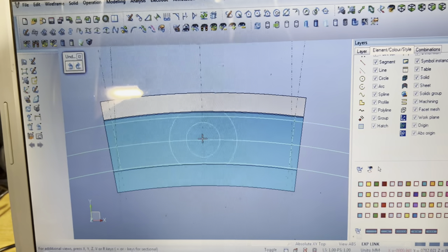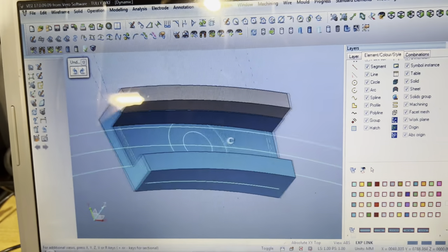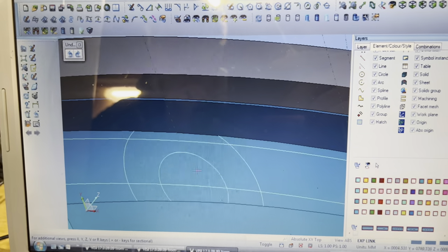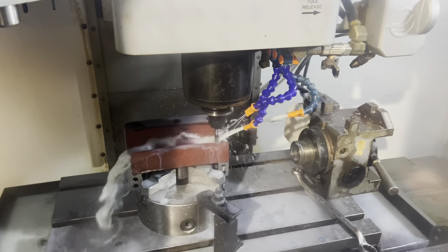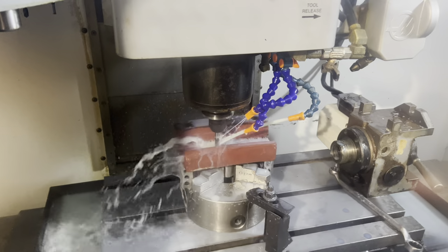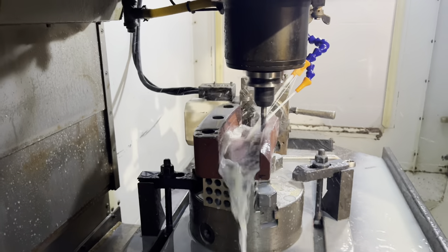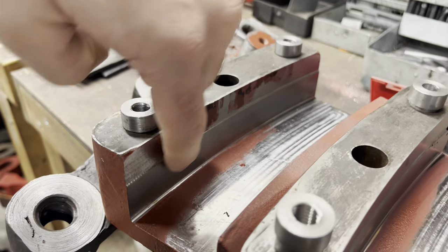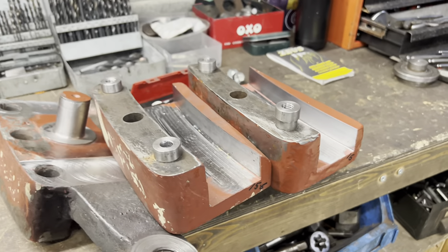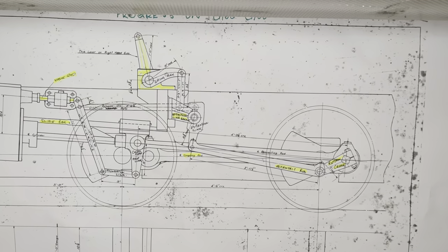The machining of the slideways in the expansion link was a little more tricky. The drawing shows what we found in reality — there was a larger gap at the back than at the front, meaning they'd worn more toward the back. We took a decision as to whether to machine them symmetrically around the centre again, or to just make new smooth surfaces and make an adjusted die block that was larger at the back to match what we had. We ultimately decided to keep the centre of the worn expansion link and make new smooth surfaces, machining as lightly as possible to leave as much material as we could. Later we'll make a brand new die block to fit exactly what we had.